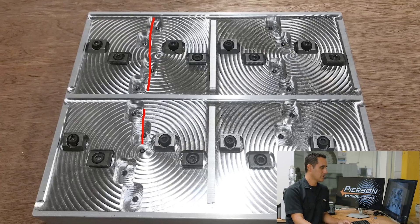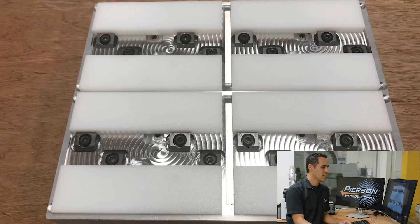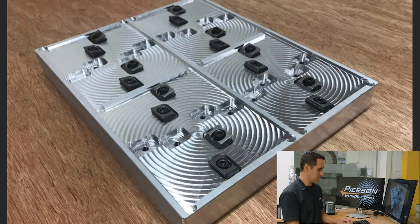Now what has he done that's unique? It's obvious here. In the previous fixture, his clamps were going vertical from our viewpoint; now they're in a horizontal configuration. Why would he do that? Because he has two different sized parts. This is incredibly efficient — not only is he using one pallet to hold eight parts, but he's also configured this pallet for dual function, holding two different bar stock widths. They're different colors and slightly different sizes, making differentiation very apparent.